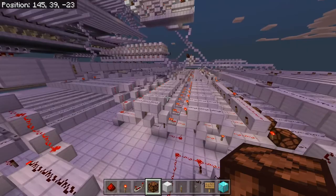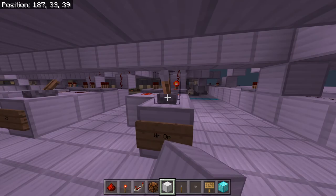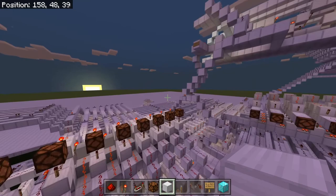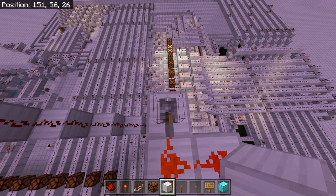I need to disable the memory as well. I haven't linked up the clock to the memory, but I know. Yeah, so disable the write operation on the memory. Cool. This is a negative edge triggered design. So we can now see on the negative edge, the program counter is going to increment.